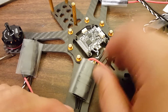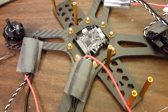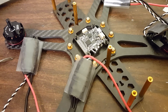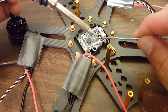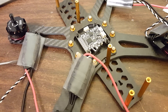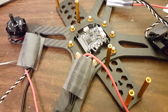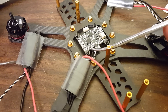I will go ahead and I will use the big solder for this one. I feel like the iron needs to be at 800 for this job because these ground connections can sink a whole lot of heat. So you really gotta get the heat in there.